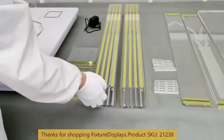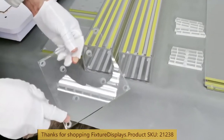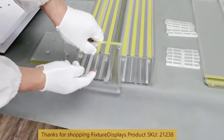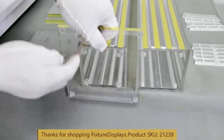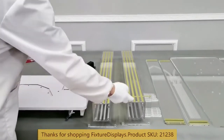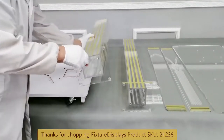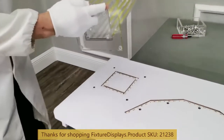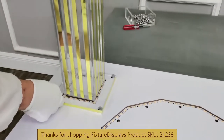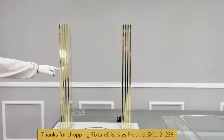The connecting pieces — the bottom side has eight holes and they are all counter-sunk holes, whereas the top piece is different, so take your time to identify that. We're going to fasten that to the bottom of the legs. Once this is ready, we set it on the podium base, fastening through the four counter-sunk holes using flat-head screws — you'll see they're flat, so when they fasten they are perfectly even.